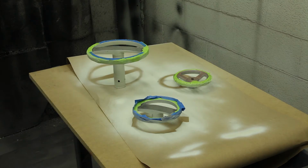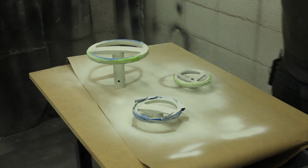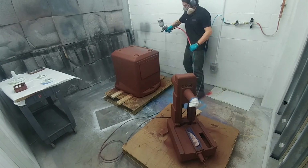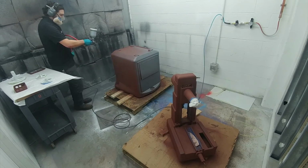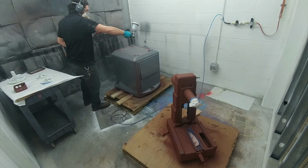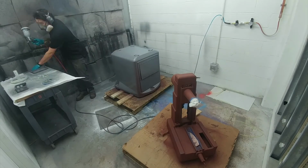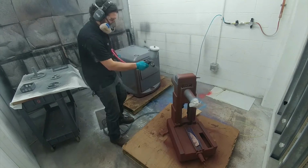Let's talk a little bit about the painting process for the surface grinder. As you see here, I'm putting on clean metal primer on these handwheels because the metal was pretty clean. It's a much better primer when the metal is completely devoid of any rust. On all the other parts, you may have seen the red oxide color. That's rusty metal primer by Rust-Oleum. On all the rusty metal primer parts, I put that on with spray cans of it because it was easier to do it piecemeal than mixing up the paint and putting in a spray gun.